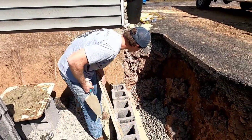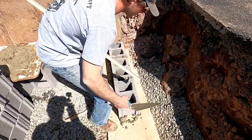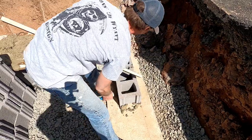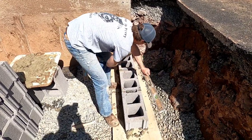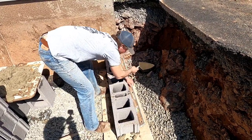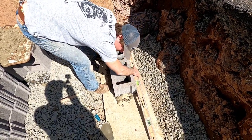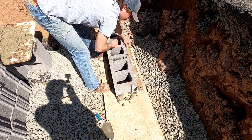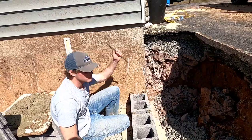I know I have to match up to this corner — it's already there, just a little bit out. Right on the corner, I know I've got to be right on this line. Three block makes four feet, that's what my level is. Corner to corner block — my most important points — I'm not touching. Everything is nice and straight. I like to tail it off, keep it nice and flush throughout. First course done — don't forget your hardware.